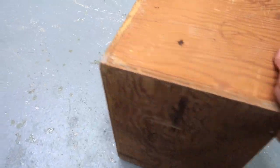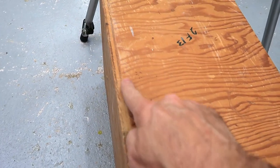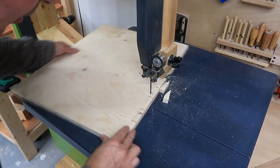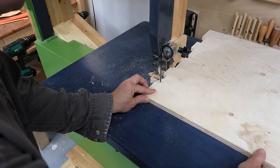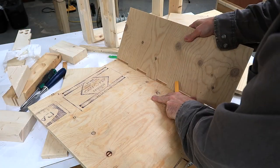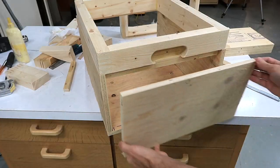For these boxes, if I'm standing on it like this then the bottom pushes against the sides and it's very strong. But if I stand on it like that then that joint is not ideal in terms of taking a load. So for these boxes I want to join the bottom with a very coarse sort of box joint to address that. I'd better mark these so I know which ones go together, and then I just have to join the ends the same way.